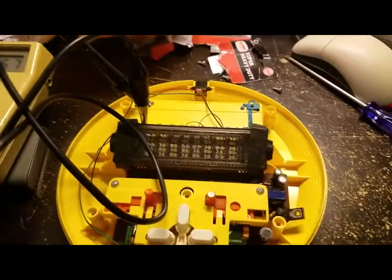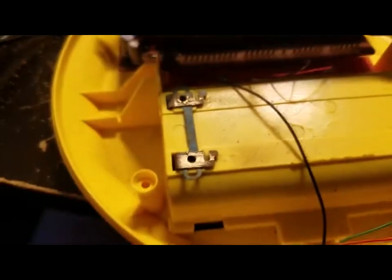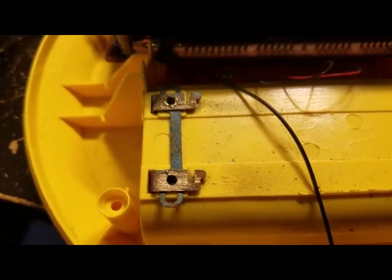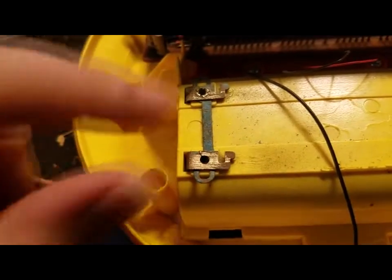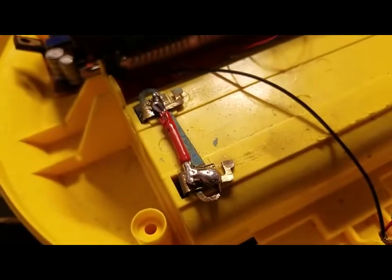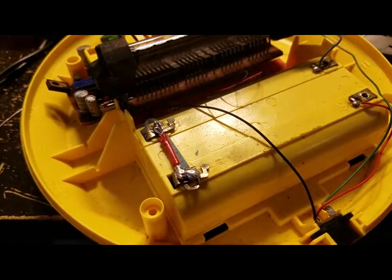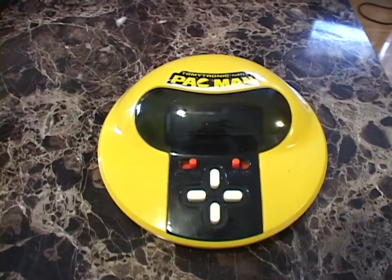But this is good news — it's just the battery compartment and not an electronic issue. This bridge is the source of the issue. The battery terminals are riveted onto this bridge piece. So because they're just riveted and not soldered, there is no electrical connection anymore due to all the corrosion. I've taken a wire wheel and I'm going to solder a wire across, then hot glue this terminal back in place because I broke the rivet investigating this. And then this thing should be ready to go. She ain't the tidiest looking thing in the world, but should do the job. It did turn on, and this thing has been working just fine ever since.